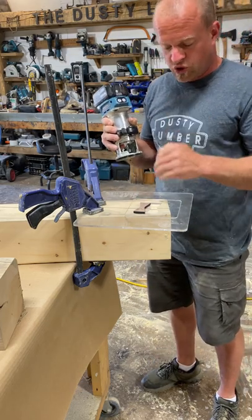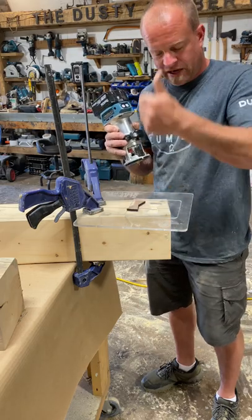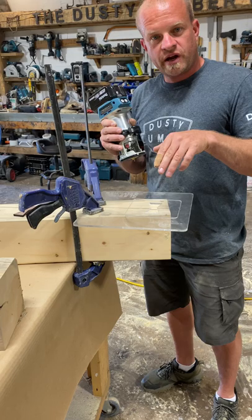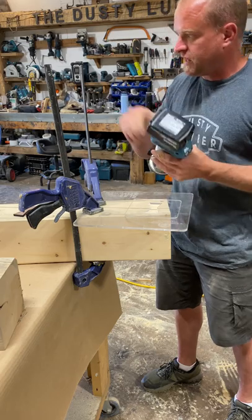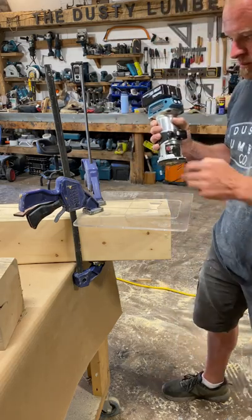You could go right exactly onto the wood but I like to leave these a little bit tall. They stand out a little tiny bit and I sand them off afterwards, because I mostly work with barn wood so it's irregular anyway and I sand it down. Turn on the router, cut around the outside, finish off the inside. You've got to blow it out a little bit because it stays inside, and then put your bow tie in.